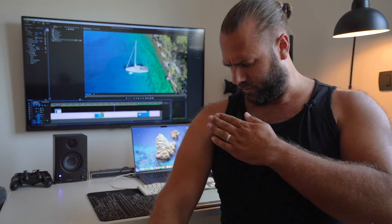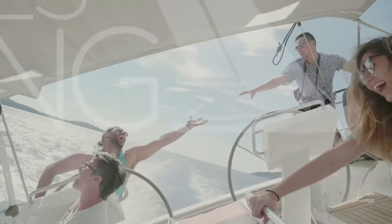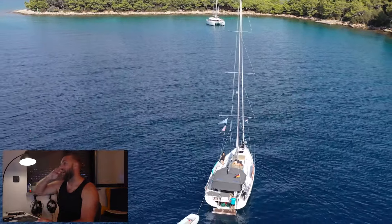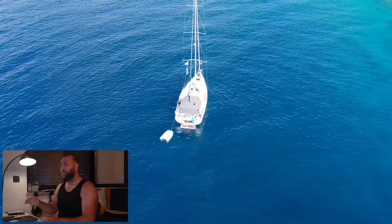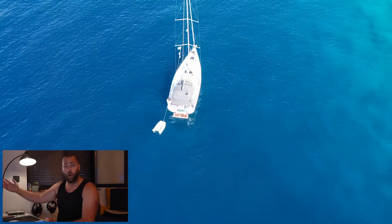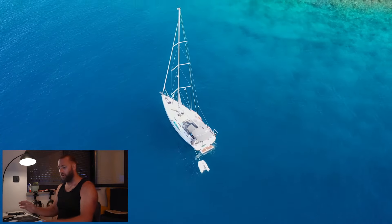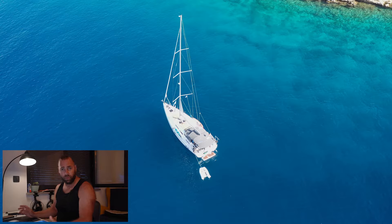Let's dive into this video. We've come into this bay — there's one other boat. I'm going to try and pick a location with the wind coming over my stern when finished, because then you put all the weight on your stern lines and not as much on your anchor, which means you're relying on the trees or the rocks — whatever you're tied to. That's great because you're not pulling against your anchor.